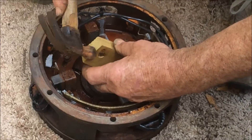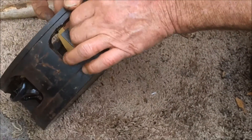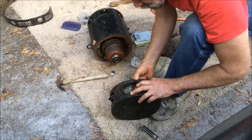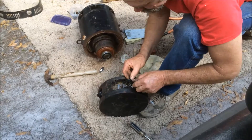At the same time, if they don't come out you may need new brushes anyway. Pulling on the wires to get them out sometimes works, but many times it just pulls the wires right out of the brush. The brushes want to be able to slide up and down pretty freely — they shouldn't be binding at all, because they've got to press on the armature.